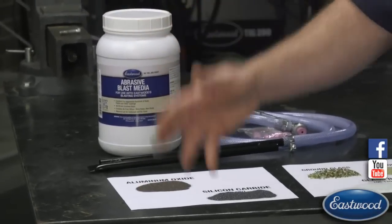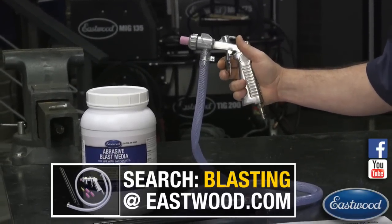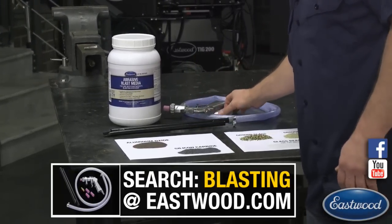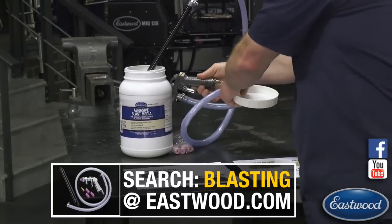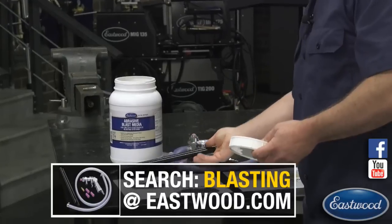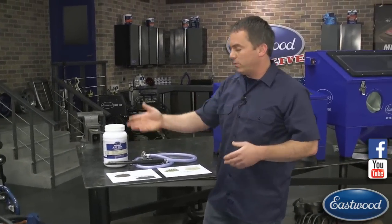If you're thinking about getting into blasting and not sure if it's for you, we have this small job blast system. We've upgraded it - it now uses the same high-quality gun as our blast cabinets, and we've improved the pickup tube which really helps media flow. You get some extra consumables. All you do is get your media - ground glass works well here - stick the tube in, connect the airline, pull the trigger, and you're blasting. There's not a lot of commitment or investment.